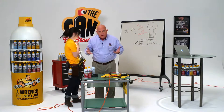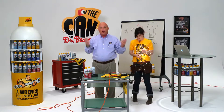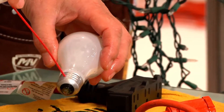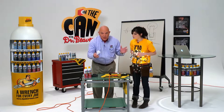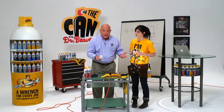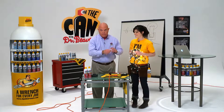Also, it protects the connections and keeps them from corroding in the wintertime. You can also use it on the base of a light bulb. Apply some silicone to the bulb base, smear it around, let it dry, and then you can just screw it right in. It makes replacing the bulb later a lot easier and cuts down on corrosion of the aluminum base on the bulb.